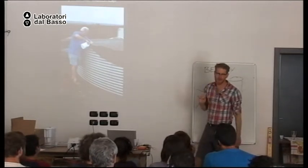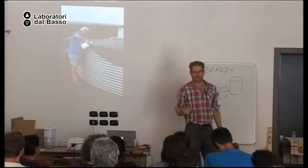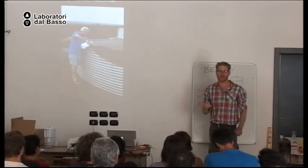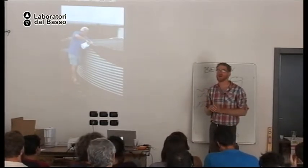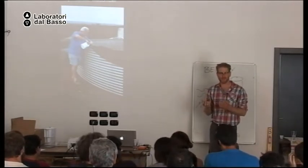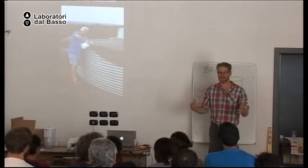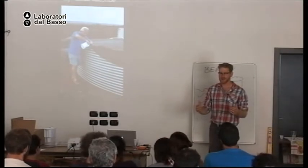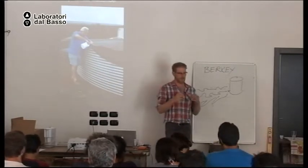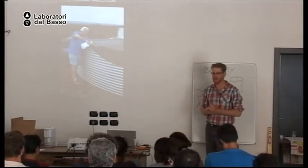And if you want to know how much, it's all in that book, okay? But there is a risk of using bleach to treat your water. If your rainwater has a lot of organic matter in it, the chlorine will interact with that organic matter and create toxins. So you can only use bleach if you have good, clear, clean water with very little organic matter.